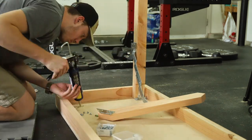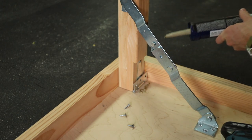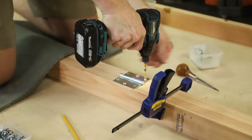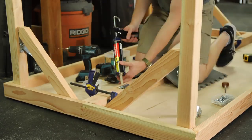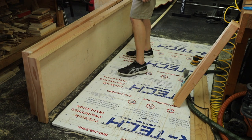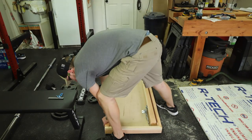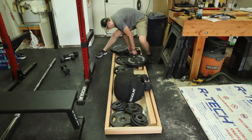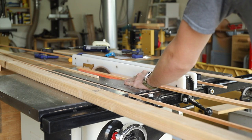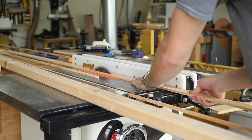Of course I had to learn this the hard way. Several hours later I realized I had to add the other brace in, which meant another trip to the hardware store to get the right hardware. This took several hours of really stretching my brain. One thing that added a lot of strength was adding some construction adhesive to the metal parts joined to the wooden parts. I then decided to add another piece on top — a quarter inch of Douglas fir paint-grade plywood — because the folks getting this table wanted a nice smooth surface they could paint on.